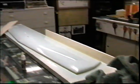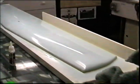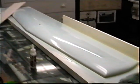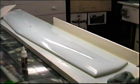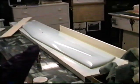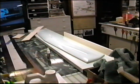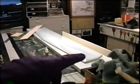Now, while I'm waiting for Les to get here, I wanted to take the mold that's going to be our Cardinal kit wing. You can see I've got it pretty well polished and waxed. I put a tape band around the edge just so I can get a nice line to cut the two halves apart. And what I'm going to do now is build a box around it, off camera. Within the next couple of days, we're going to set up a dedicated day that Les and I are going to make the mold. And that'll be pretty labor intensive. But I can get the box made today and get it all prepped.